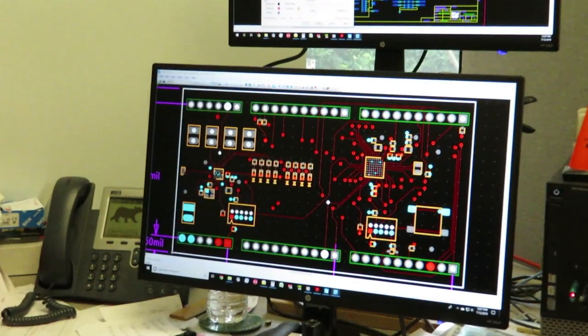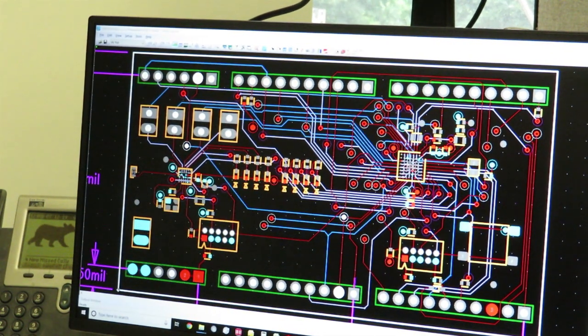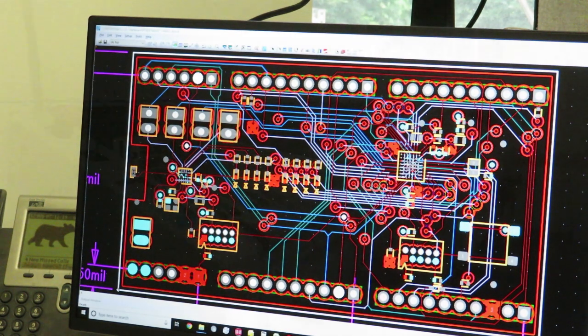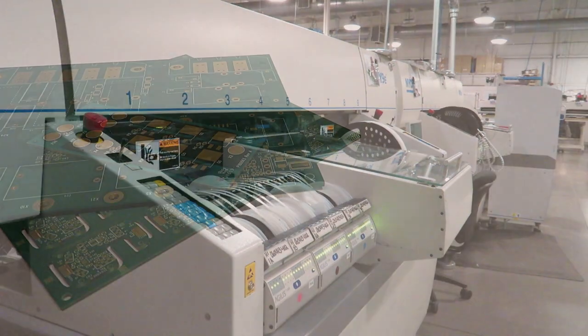Each additional set of layers increases the materials cost of the bare board, but makes it easier to lay out the design and achieve high component density. Since there's no impact on manufacturing cost, this trade-off can make sense when small board size is important.